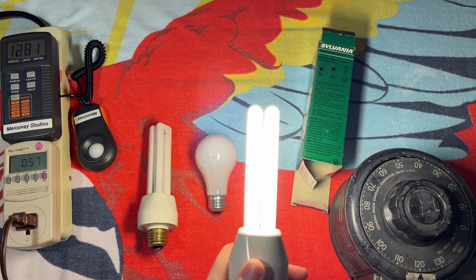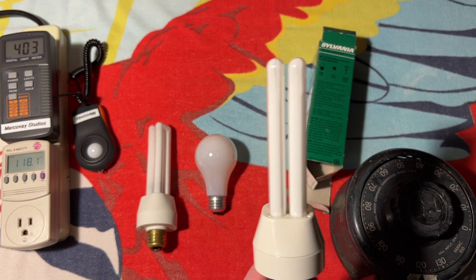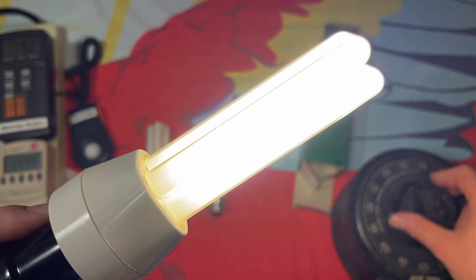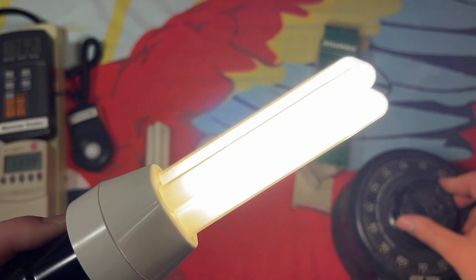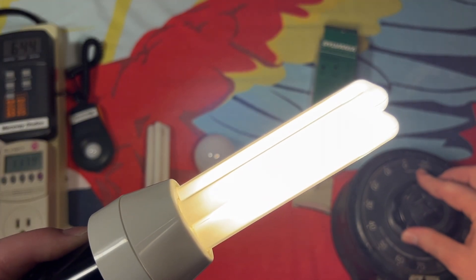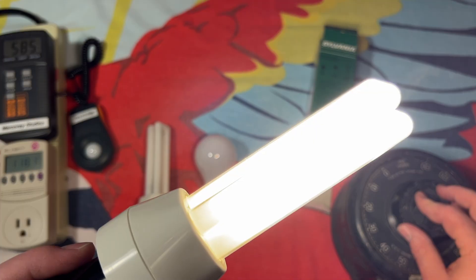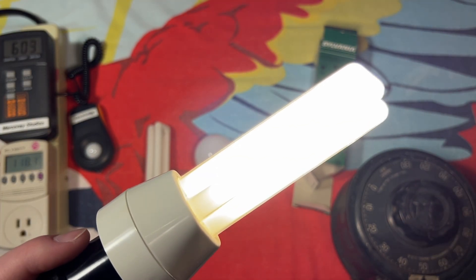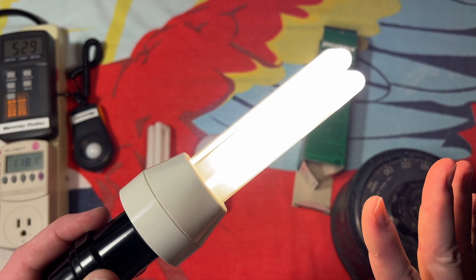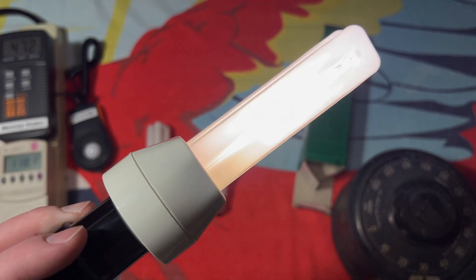With all that being said let's go ahead and see how well it plays with our variac. Now obviously these are not dimmable, but nobody said we can't experiment. There's our bulb. Let's start dimming it down — we're at 120 volts right now. 110, 100, 90, 80 — it's holding up its lumens pretty good. 70 — a little bit dimmer but not terrible. 60 — it's still holding up pretty good; I'm surprised for half the voltage. It's starting to have a very light flicker to it. 50 volts — wow. 40 volts — this is really holding up. Obviously it is dimmer, no doubt about that, but it is holding up well. It hasn't lost its arc yet. Wow, 30 volts — it's nice and dim though.